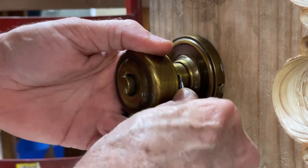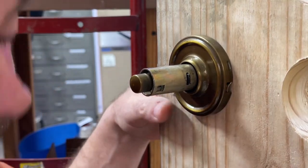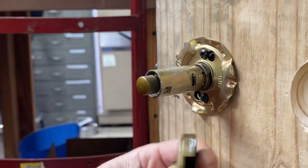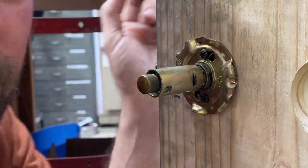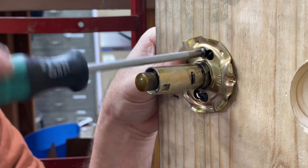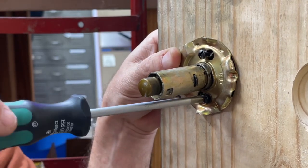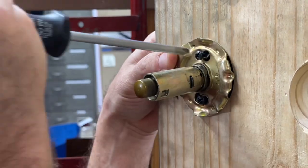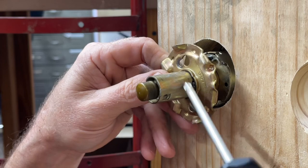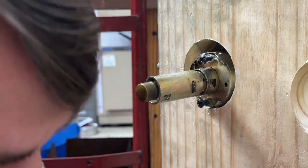Here's the important thing: you don't have to take it off if it's tight and functioning fine. But if you're changing it out, this is where it comes in — how does this come off the door? There's a little notch you can put a screwdriver in and pop it off. That exposes the rosette, and then you just have to unscrew it a little bit to be able to twist this rosette — just like that — and this comes off. Now you can either push your retainer in or turn this until it gets to the area where the retainer lines up. They actually very nicely put a cutout right there for you.